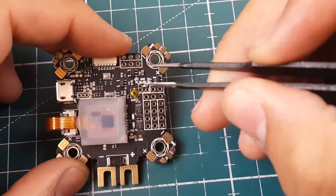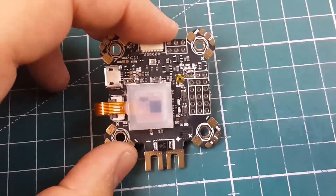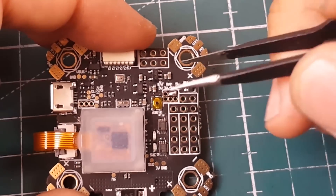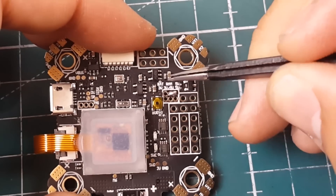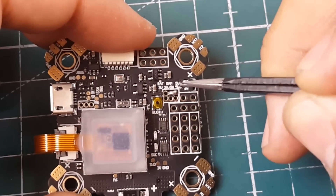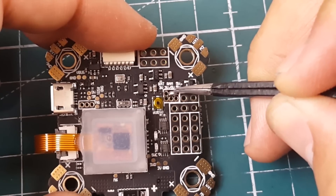Moving up, we have a buzzer and a couple of LEDs. There are pads labeled RAM, 5V, and BAT. Any pad called RAM can be changed — bridge it one way for 5V output, or bridge it toward the BAT pad to get battery voltage.